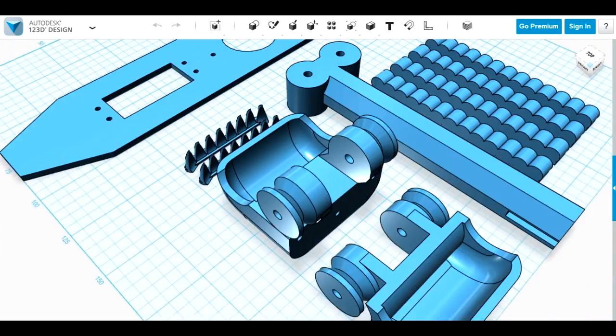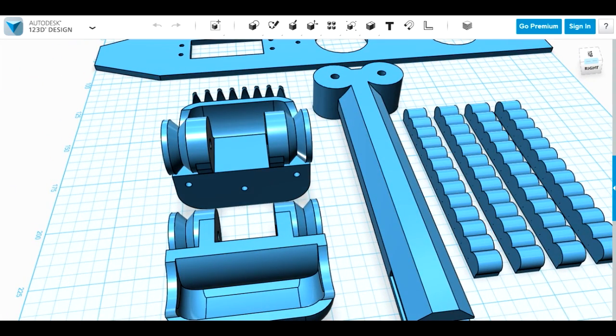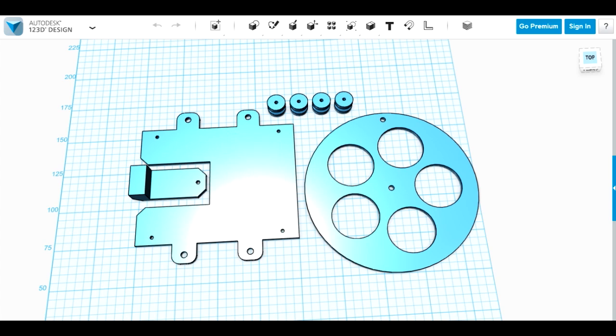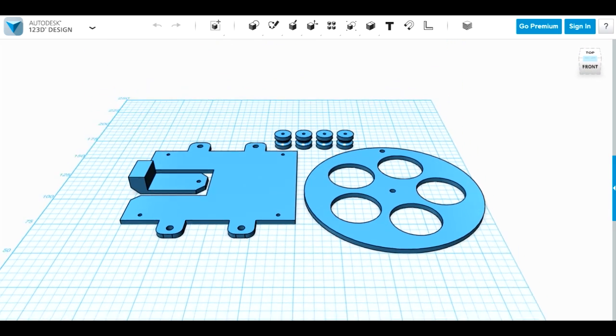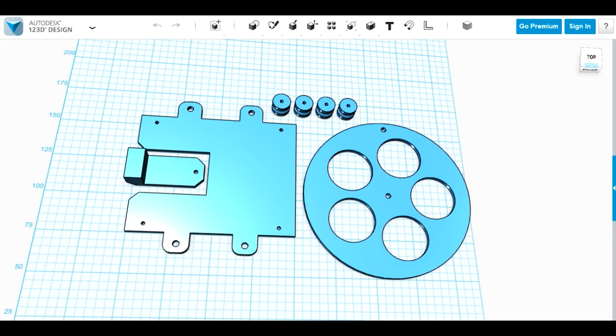That servo will push a rod to operate the bottom of the middle jaw. You'll notice there are rollers on the top and bottom of the middle jaw with V-grooves in them — I'm going to have a figure-of-eight drive belt between them which will hopefully keep those in sync so the top and bottom open simultaneously. Here's the piece which that slots into: four rollers fit into the four holes at the corner. There's a big wheel that rotates to push the flat piece in and out, sliding the inner jaw mechanism. I haven't decided what drives this wheel yet — probably another servo fitted at a later stage. The little L-shaped piece holds that wheel raised above the sliding piece. If I print all these out hopefully we can put it together and see how it works.